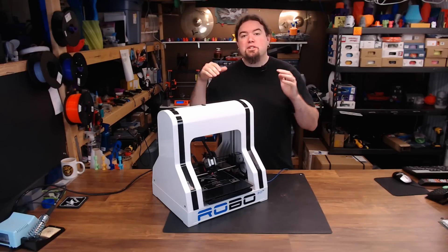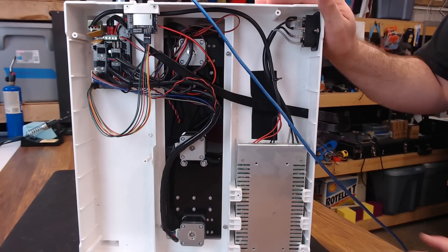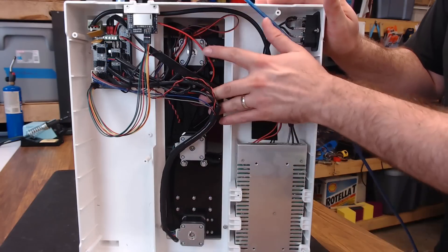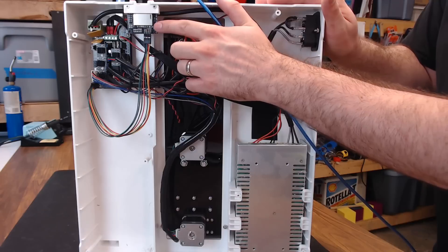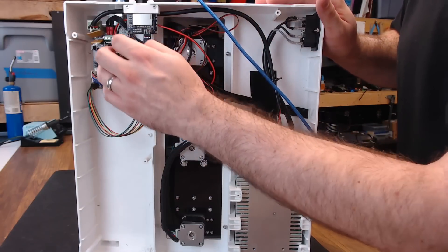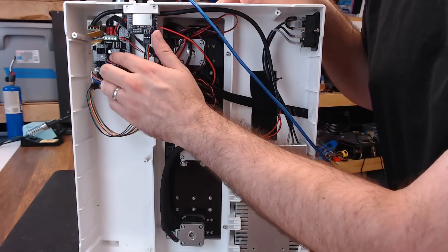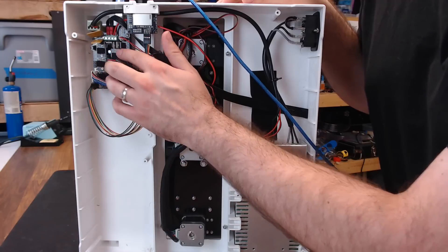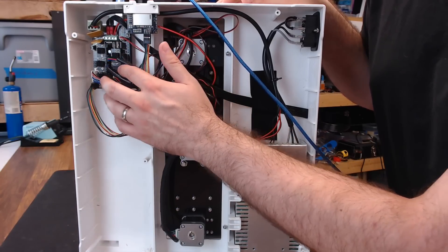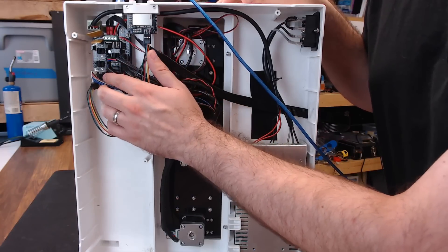Now let's take a look at what's actually inside this machine. When you pop the bottom access panel off, you're dealing with a standard 30-amp 12-volt power supply and standard NEMA 17 stepper motors. There's a breakout board for a full-size SD card cabled to a RAMPS shield with a genuine Arduino underneath. The RAMPS does seem to be populated with A4988 stepper drivers. You get all five, but they're using the usual second extruder position for one of the Z motors, so each Z motor gets its own driver.